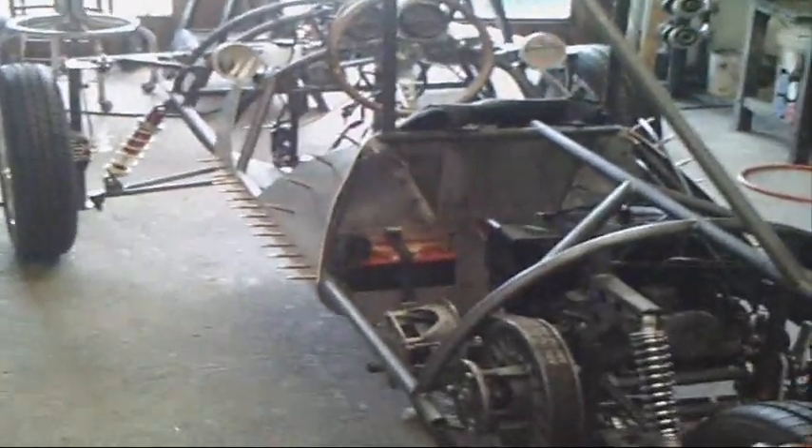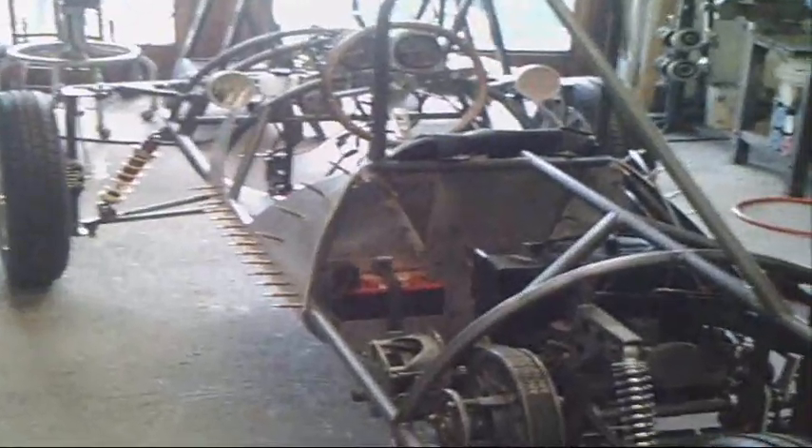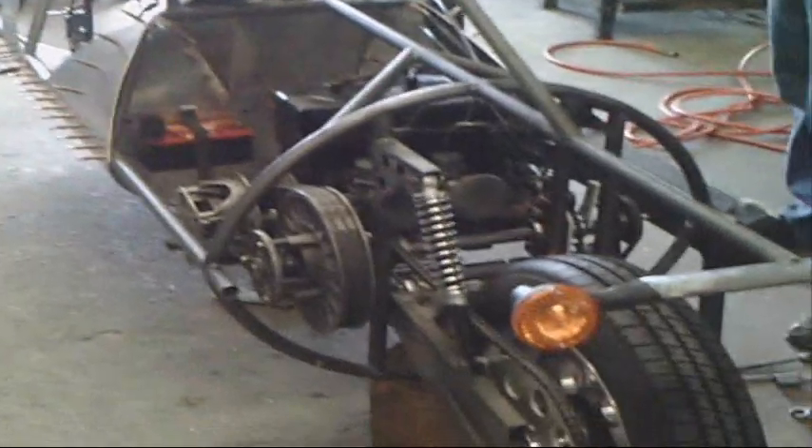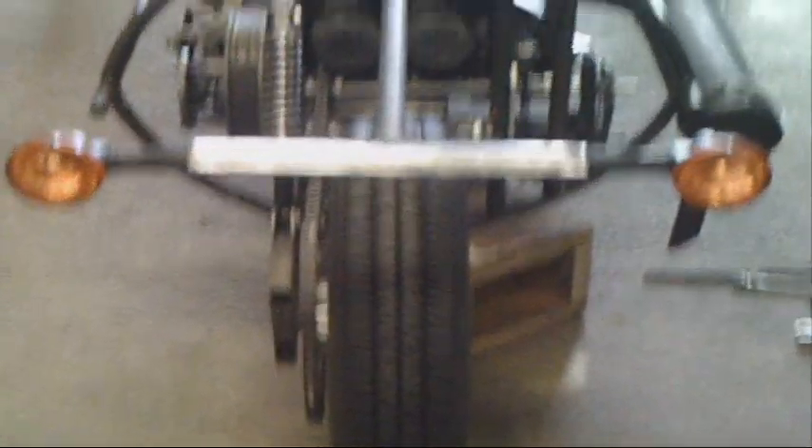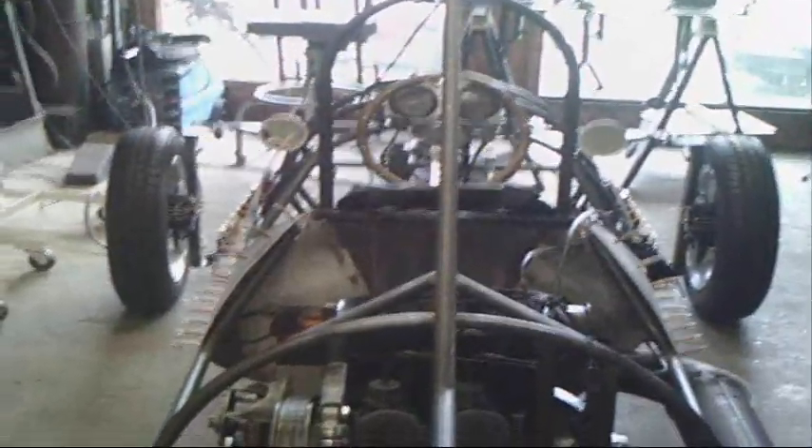We're probably going to pick up an additional 25 pounds or so to add your lights and turn signals. The sheet metal — everything's going to be sheet metal. The only fiberglass would be a fiberglass gas tank that sits in this area here, and it also has the oil reserve for your two-cycle and holds the gasoline you need. So hopefully they'll both run out at the same time — you run out of gasoline, you should run out of oil for your two-cycle.